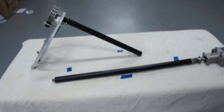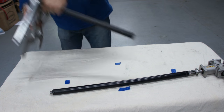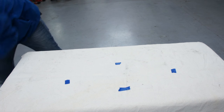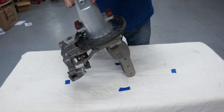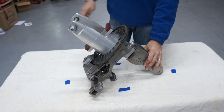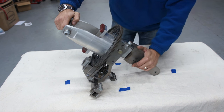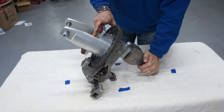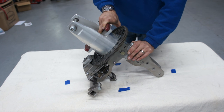And for those that are curious as to what the actual rotor head looks like, well, I have one to show you guys. This is our rotor head. The tower is made out of a solid piece of billet aluminum that is machined. The rotor head itself operates on two pretty large size ball bearings, which provides for a substantial number of hours of continuous operation without the need of much servicing or replacement.